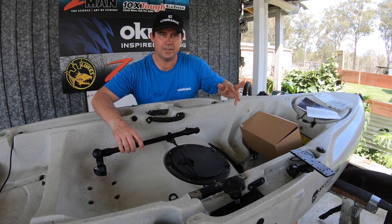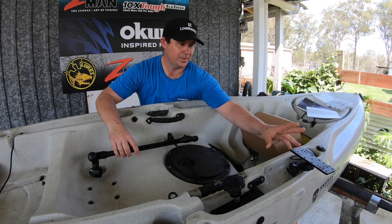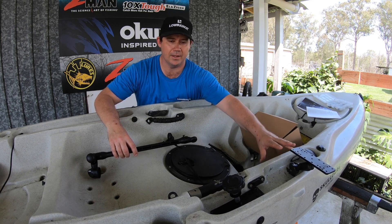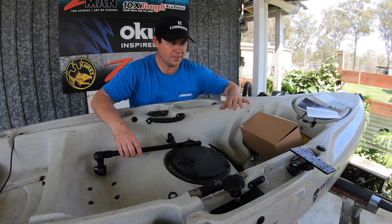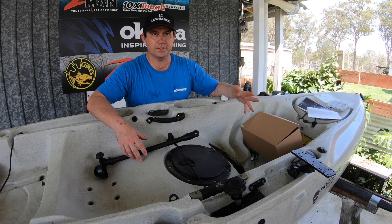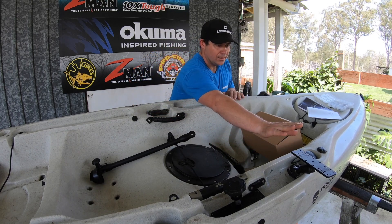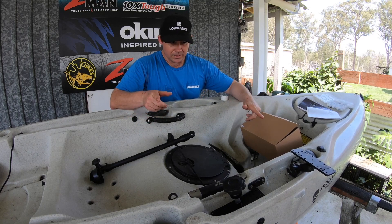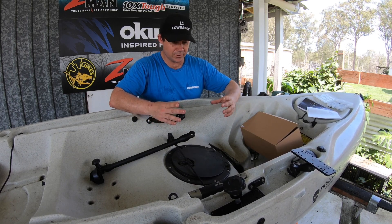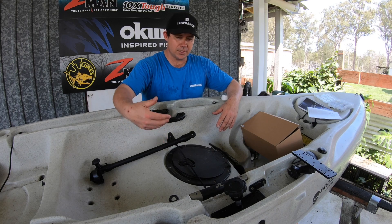So straight up, there's a couple of things I need to consider. Not so important on this because I've already got the display where I want it located on the side. This RAM bracket's already fitted into this kayak, so I'm pretty lucky there. But if I had a new kayak and I was starting from scratch, depending on whether I was left or right handed, I'd decide what side of the kayak I want the sounder to be on. I'm right handed and I prefer all my electronics on the right hand side. The second thing to consider is how I'm going to mount my transducer. The FS transducers are quite a long transducer, quite wide, and they have the side scan capability. So you don't want to hang them over the side and then have one side just reflecting straight inside of the kayak.